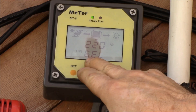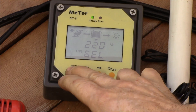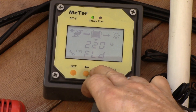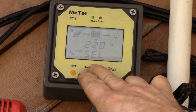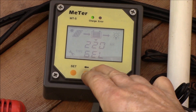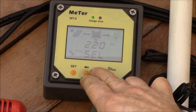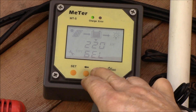Here's where I have the battery type. With the EP Solar, if you hit the set button, it supports gel cell, flooded lead acid, and sealed lead acid. I technically have sealed lead acid — AGM batteries — but I find that with flooded or sealed lead acid the controller doesn't equalize every day, and gel cell doesn't equalize ever.